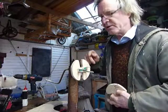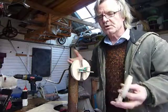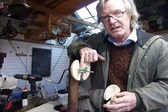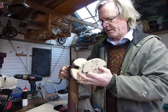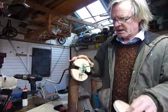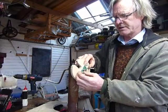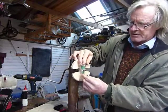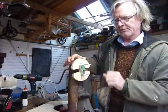It's only a 12mm spacer and the design calls for 13mm. I actually wanted a little bit more voltage and a few more turns, so I put some 2mm plastic packing on there to get a 14mm spacer to get plenty of windings on. I'm winding the coils onto these corners — they're 6mm bolts with a smooth surface. I've allowed a little bit of play so that they taper inwards so that the coil releases easily.